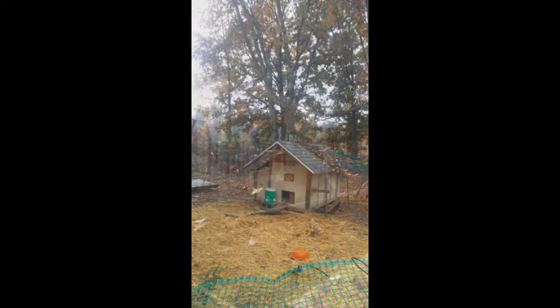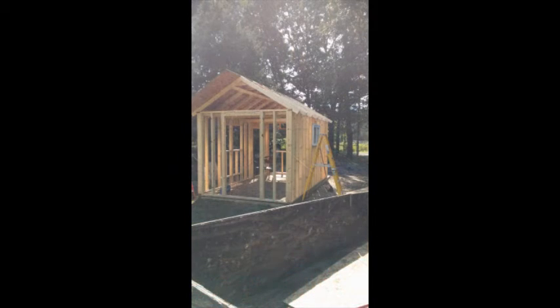This is the new coop. To save time we purchased a Costco shed — it's 8 by 14, and they had it on sale last summer. We ended up making so many changes that it probably would have been better to just purchase a lumber kit and build from scratch. We added an awful lot of two-by-fours, sturdied up the trusses, added studs on the walls, reframed the front, and added a 36-inch pedestrian door. We also added an overhang and changed the flooring installation completely.